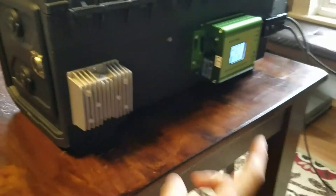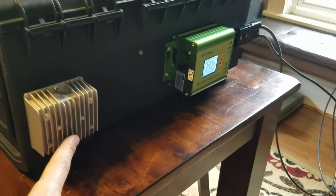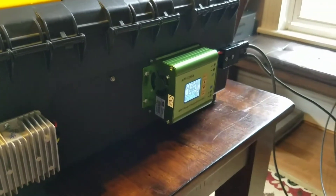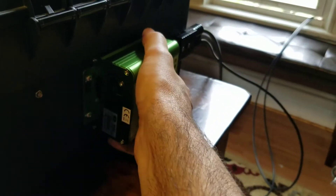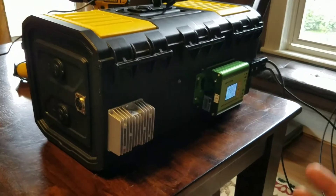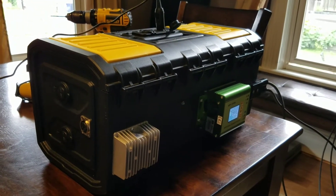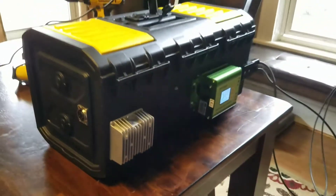You may wonder why I mounted all this on the outside — it potentially generates heat in the conversion process from stepping down from 36 volts, and as you can hear it sounds like a hair dryer. I could probably mount it in the box, but imagine the closer it gets to 10 amps the warmer it will get. Right now it's putting off no heat at all — it's not even warm to the touch after almost 20 minutes.